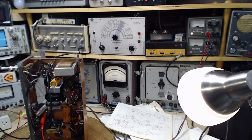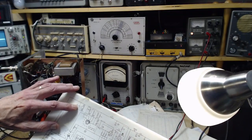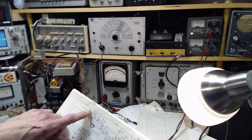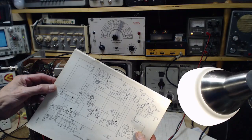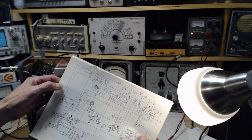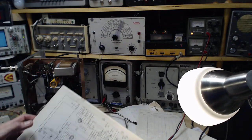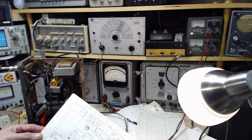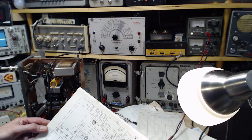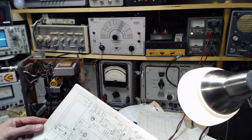Flowing through leaky capacitors, bypassing that coil? I can't imagine that. Got a capacitor here, it could be leaking current. The coil could still be open, but I think it'd be pretty tough to leak substantial current through any of these capacitors. That's really about it. So I haven't proven this to be open. I've got a strong indication that it's not open. There's a remote possibility the current flow is going through that capacitor, but that's really, really remote.